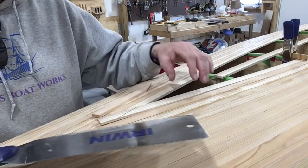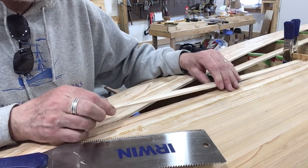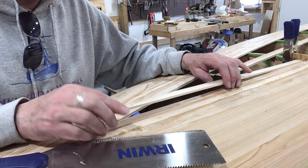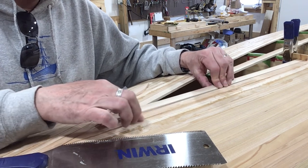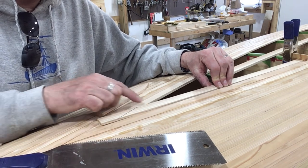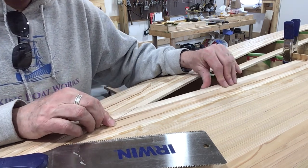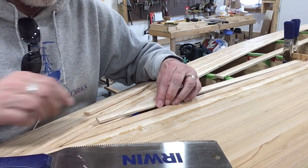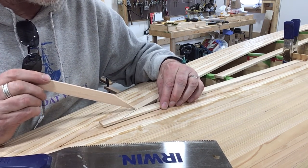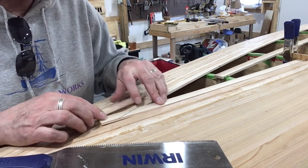I want to make a couple of comments about cutting the ends of the strip to fit in to the next place. I'm going herringbone here — every other one — and I've got patterns. This is a kind of a clean no-grain type strip; this one had a lot of grain in it, similar to this one. So I'm doing an alternating thing with my woods. Then I find my point where the front end has to meet up right here, and also where it matches here, so I make my marks on my strip and then we can cut those.